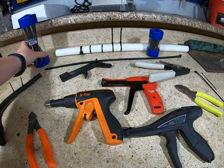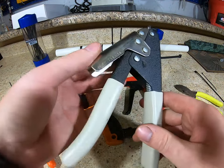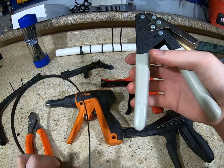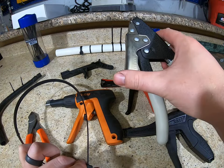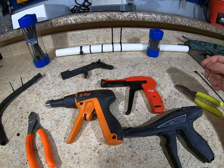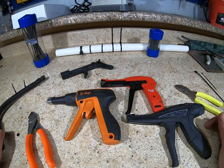This guy — I'll knock it out quickly. They have this same style tool under a number of different brands. This is a Malco, made in the USA, about 40 bucks at Home Depot, and it's for the heavier-duty 3/8-inch zip ties. I had a Stanley version that had a little more flex and I didn't like it as well. They do make a gun-style for those bigger zip ties, but they're significantly more expensive and I don't use enough of those big zip ties to justify the cost.